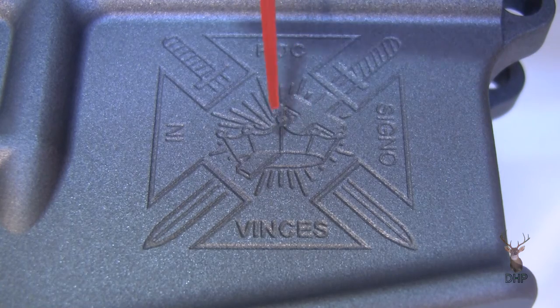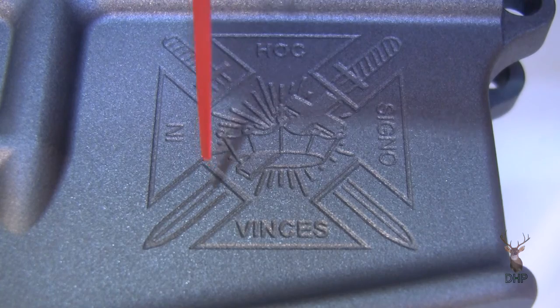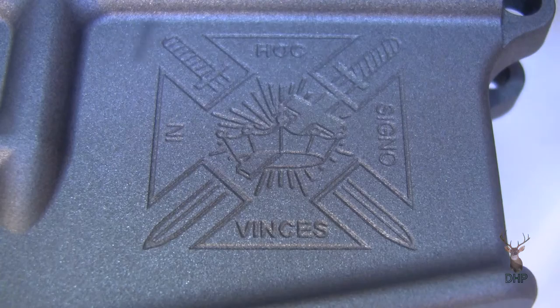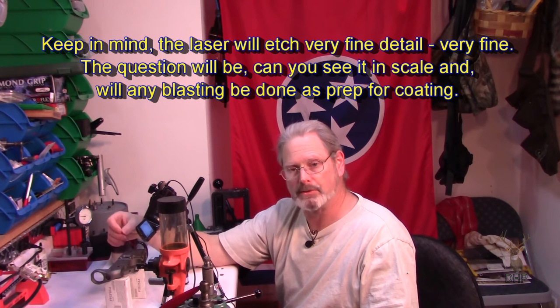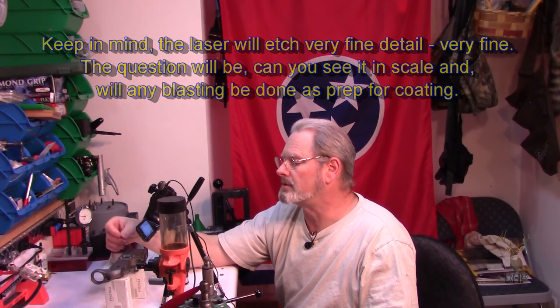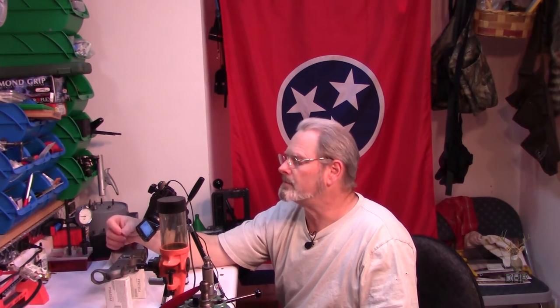As you see, it's fairly intricate, and this was my first attempt. The line width I used was 1/32nd minimum. I believe I should have allowed for a little more space between valleys — between features I'm at about 3/64th. Right in here you can't quite make out where the rays come together and the cross on top of the crown. It's just a little too tight. There's not enough material left high, and by the time it was burned and Cerakoted, blasted and all that, it's kind of lost that definition. If you don't try to get too fine and too detailed, it works pretty well.